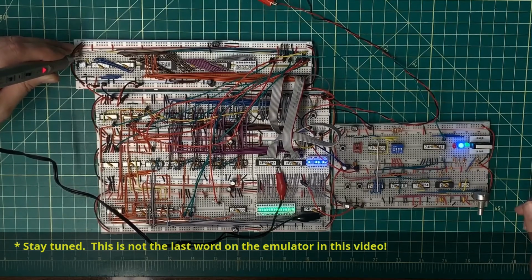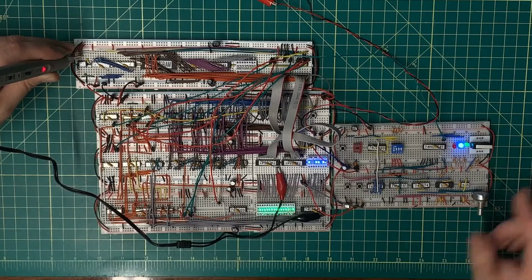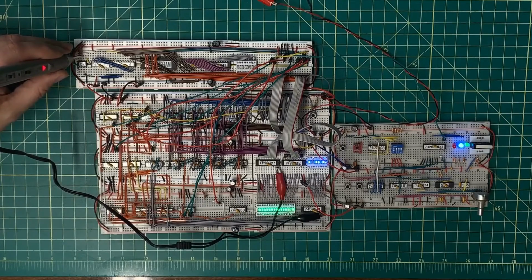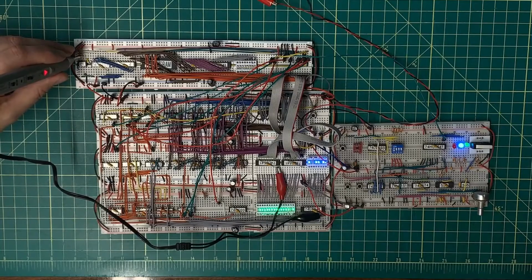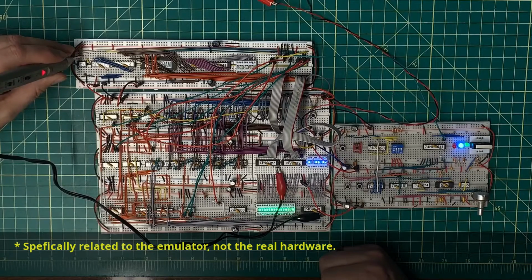Well, again, it has to do with the linear nature of how the emulator is written and in what sequence each of those connections are made. They are taken one at a time. There's nothing that says go and update all of this all at once. Everything is updated sequentially, and it's depth first, meaning it will follow that signal all the way to its conclusion, all the way down to the leaf of the tree, before coming back and then executing down the next branch over all the way to the leaf of the tree, and then coming back, et cetera, as it goes across. And if that same signal is going to the same leaf through different branches, then that's fine, but it gets updated multiple times as a result of that. The big thing here is that it is related to the sequence in which things are wired up as to how that's going to work.